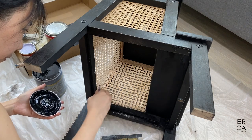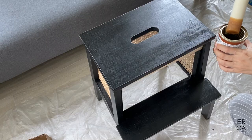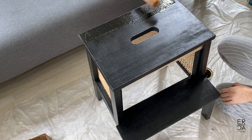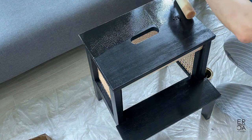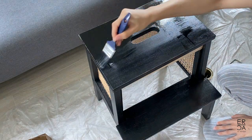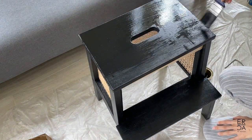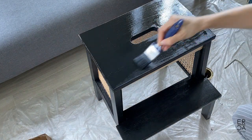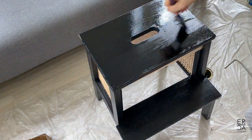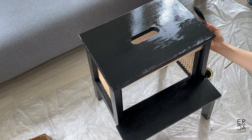You can actually see that I didn't paint the upper pieces of wood as well, since I don't think anybody's going to notice that either. The final touches were a coat of black paint to hide the nails and then a polyurethane coating. I tried first to use a foam sponge but my roller didn't actually fit, so I ended up using a paintbrush. The polyurethane needs a few hours to dry between coats, and to get a durable finish you'll need around three to five coats. I was very impatient so I did around three coats, and I'll just see how durable that is for now.